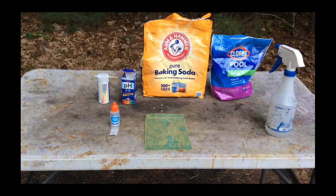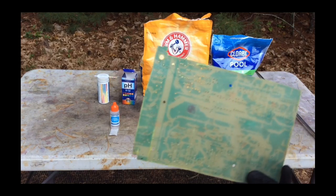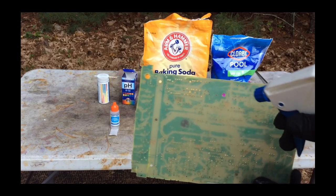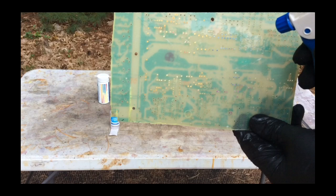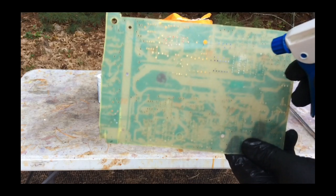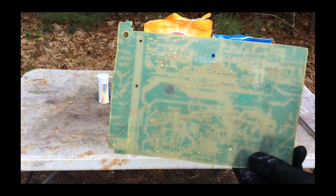I'm not treating acid peroxide — I'm treating the rinse water from my acid peroxide process, to be clear. The rinse water is the water I've accumulated as I'm spraying the boards to remove any lingering gold traces. The rinse water falls into a bucket along with some residual gold traces, and it's that water I'm treating in this video. I expect it only to have dissolved copper in it.